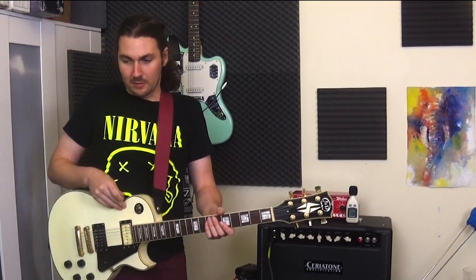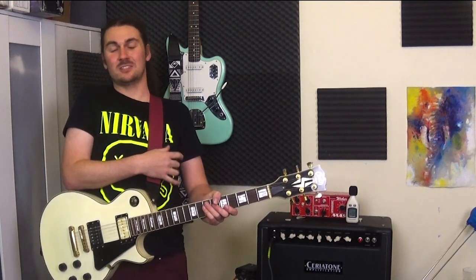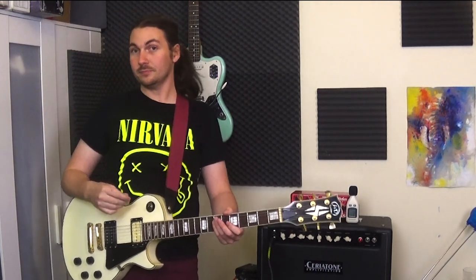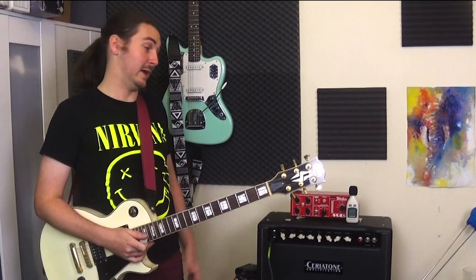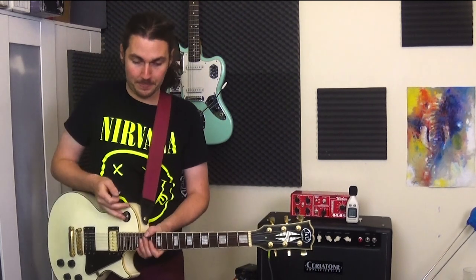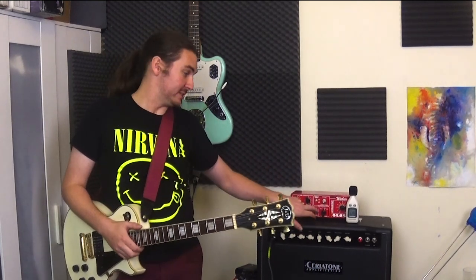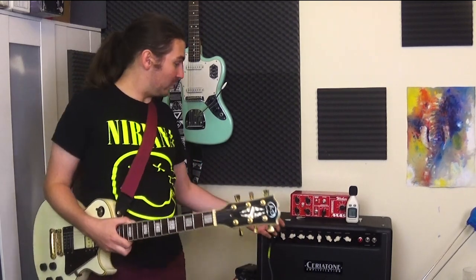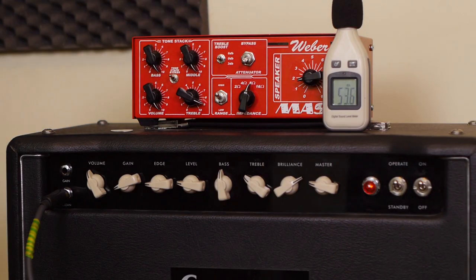You can change the input signal and it will change the output signal by the same amount of decibels, but it's all logarithmic, so it can seem a bit confusing. Let's say your guitar's going in at a certain voltage and you increase by three decibels — if you're running at 80, that just goes to 83, it doesn't feel much louder. But if you're at 100, three decibels is a huge amount of increase. You need a power amp that produces more power, but that's why we're talking 50-watt, 100-watt heads. This is only 30 watts, but it can still get about 100 dB fairly clean.